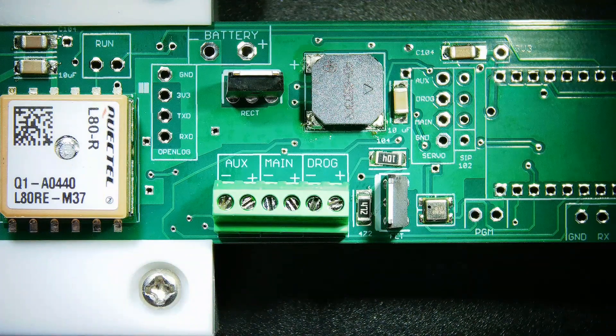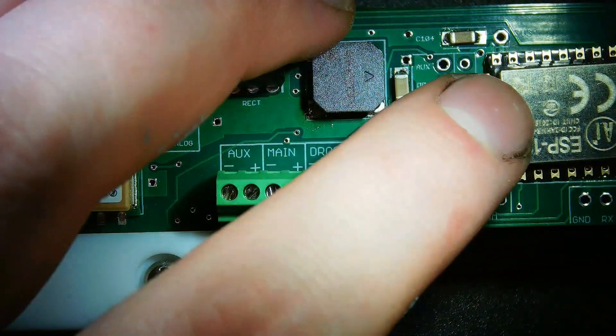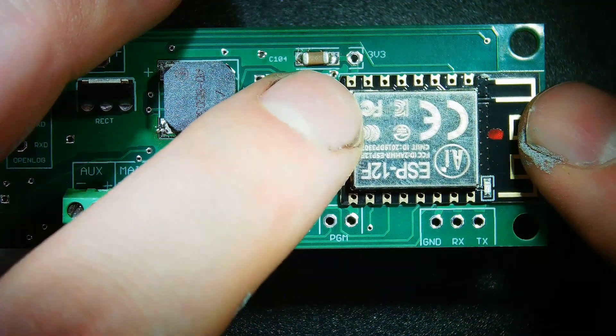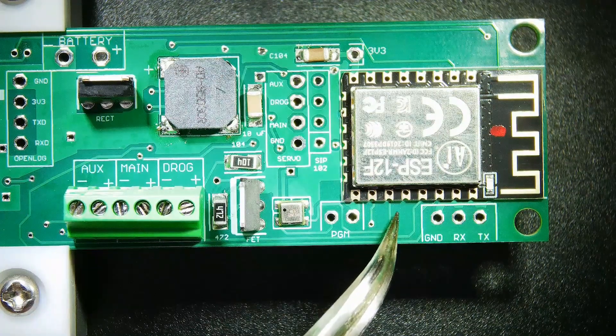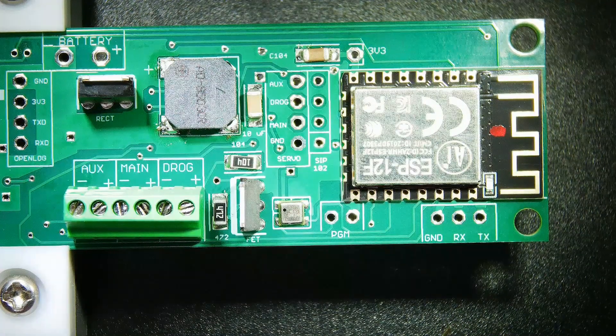Going to lock this into the vise, find my ESP which is this little guy, which will go down just like this. Now my one critique about this kit is if you extended the pads out further - and there's plenty of room to do that - then you can skip the whole resistor lead soldering and just solder straight to the pads like every other ESP kit. And that would make this kit a lot less frustrating. This is the worst part of these kits in my experience.